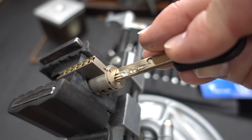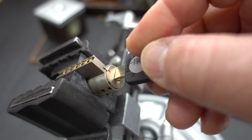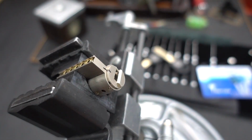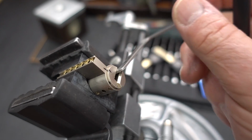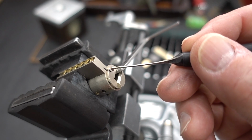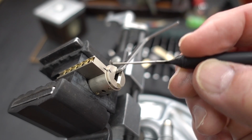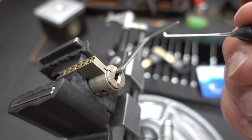All right, guys, I took a second to read this. This is actually a padlock core. It rotates 90 degrees. I read Ted's letter, and he says this is from a batch of Mul-T-Locks that he's found exceptionally difficult to pick. So it may be a form of challenge lock, but maybe straight from the factory. I've drawn a line with a little black magic marker, so when we get hung up on those inner pins, we should get a pretty significant false set.